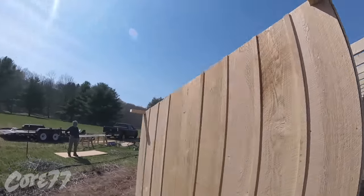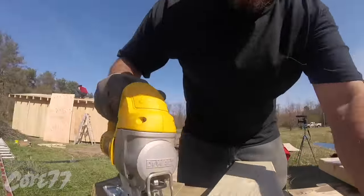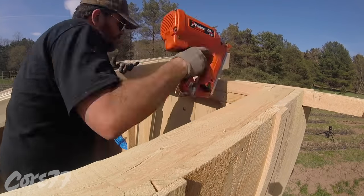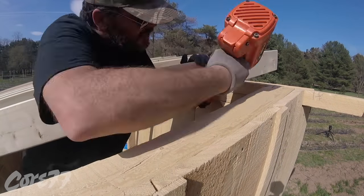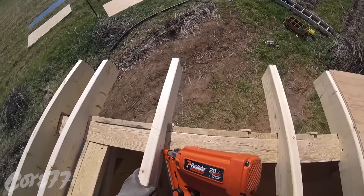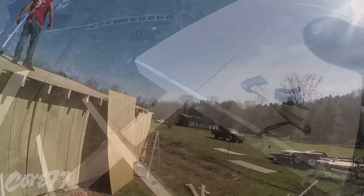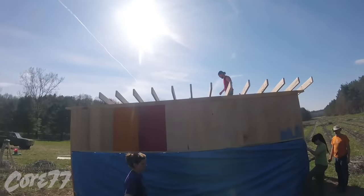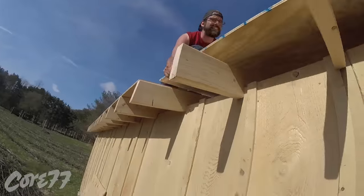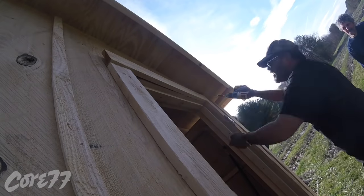Here I am using a jigsaw just to cut notches because we were too short. You see me putting those couple in, and I'm using a Paslode air nailer for framing — something I don't get to use too often. It's basically a cordless nail gun that works with an electrical charge, a battery, and propane or butane to set off the nail. There you can see the client's assistants painting the 18 sections on the front — 18 different colors. I think those 18 different colors have something to do with the bees finding their way home.